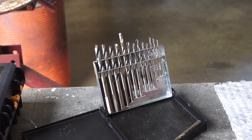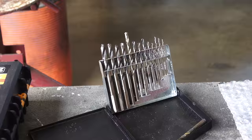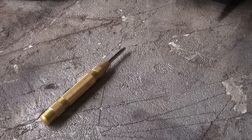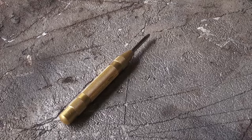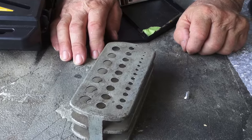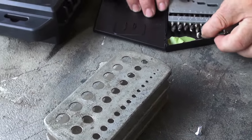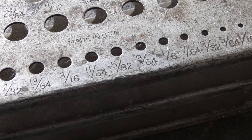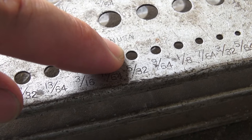Open up your drill bit set and figure out which drill bit you'll need for those screws to fasten through the body. You're also going to need a punch to get a starter hole going — a dimple. We're test fitting the small screw to determine which drill bit to use. It's going to be the 5/32nds drill bit.